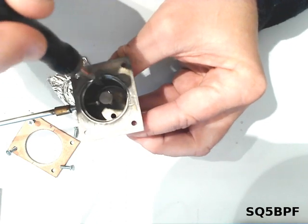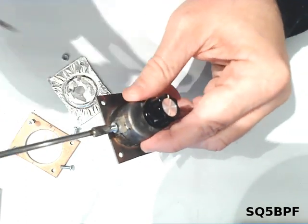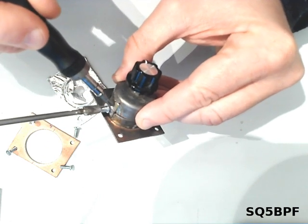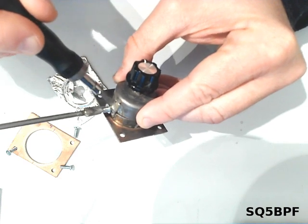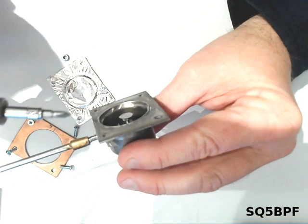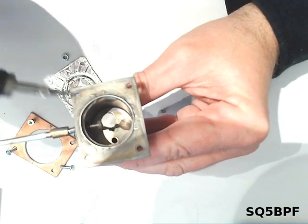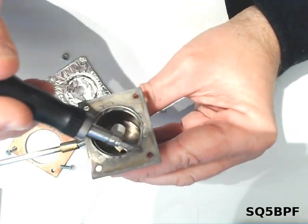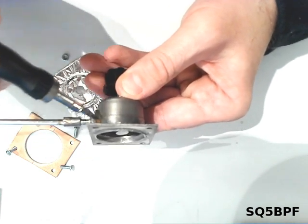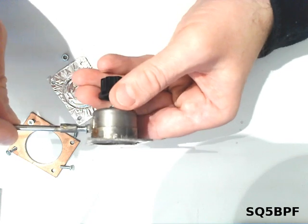This is silver plated inside. And this feed-through hole, this feed-through is made from normal PCB laminate. You can also see that there is a protrusion over here. This helps contact between the membrane and this resonator, and this is made just from a piece of brass strip, which is soldered onto this metal pipe cup.